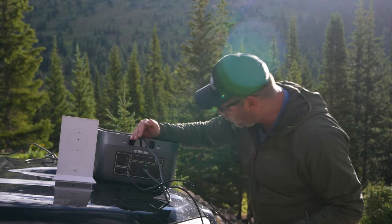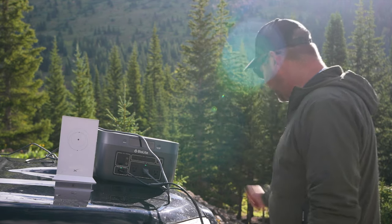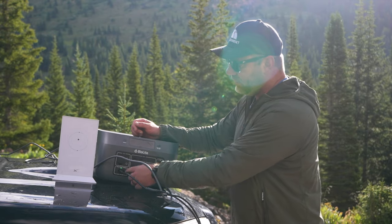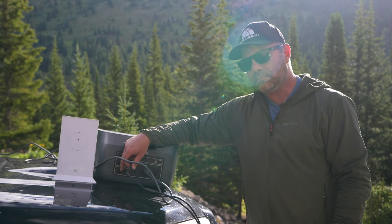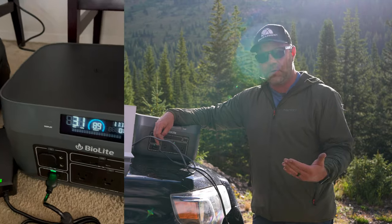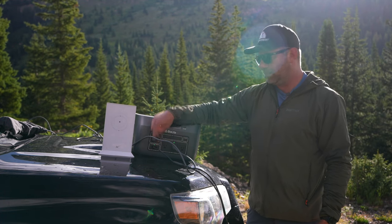I had to get a converter to go in here at 8 to 7.9mm, and it's pulling in just about 29 watts right now, which is not bad for 8 a.m. with the panel just laying on the ground. Power comes in via DC through solar panels or AC through the same port — I've not seen that before. So the power adapter you use at home plugs into that same port, not the AC out. That's how you charge it up.